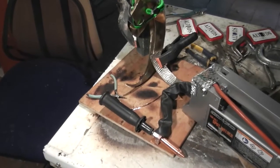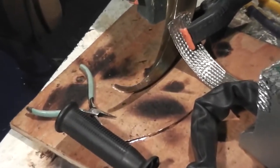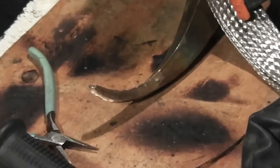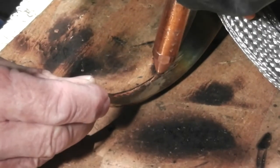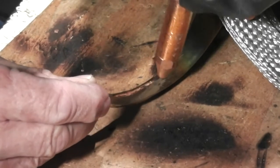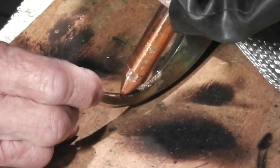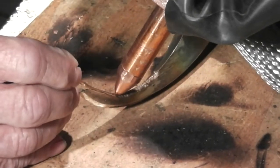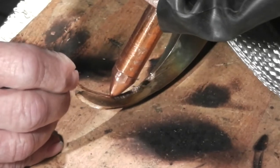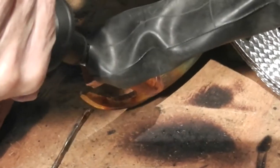This setup is for welding a very thin edge. Two bottom cables are used for this weld. A piece of flat filler material shaped in a V and formed to the piece is used with a special V welding tip. This was done prior to learning that flux is indispensable to a good weld every time. The edge of the filler material is welded on both sides using the side of the welding tip.